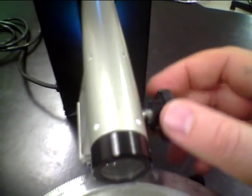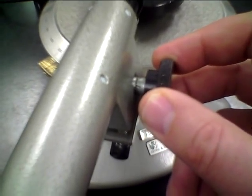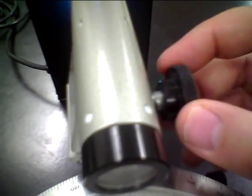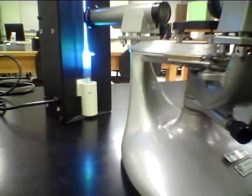The next step is to focus the collimator, and then the step after that is to focus the telescope. So we start with the slit to get very narrow slits, then we adjust the collimator to get a cleaner line, and then we get rid of the blur with the telescope focus — we do it in that order. When we're done, these lines actually look pretty nice. You can see all the imperfections in the slit when it's done well.